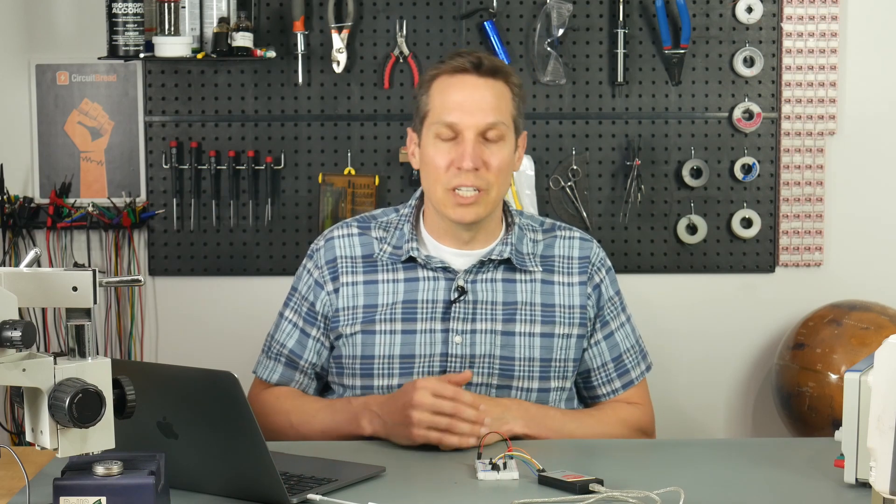But if this is all you need to do, well, it works and it's just fine — and it's a great learning experience. We will be going over in a couple of tutorials how to make it so your microcontroller is checking to see if the button's been pushed while still executing other work, instead of just sitting there asking: has it been pushed? Very inefficient, but also very simple. That's why we do it.